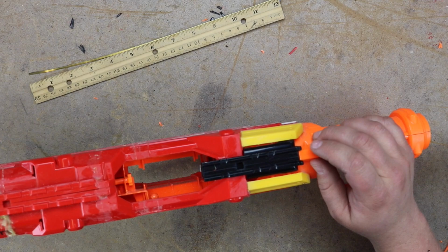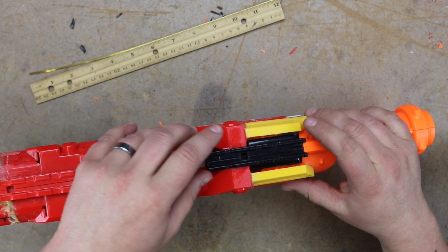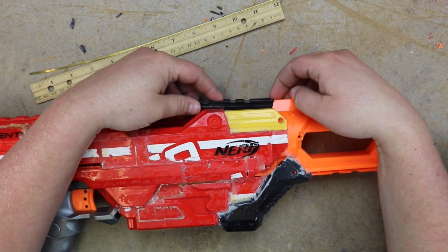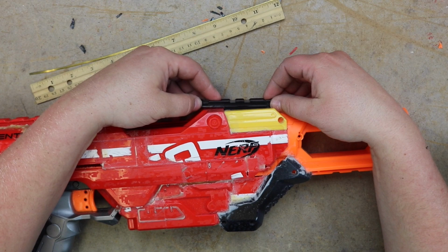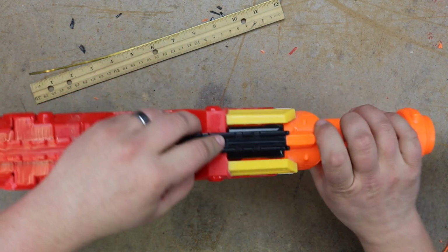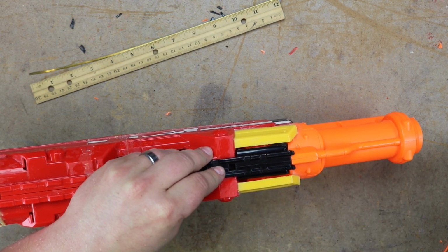And kind of like we did a while back. What the heck were we doing? Trying to fit the angle on stuff. I think I'm going to tack the front, since it's easy to find the level, or make sure that these surfaces are level. We'll tack the front, then we can fine tune the back, because it's going to be a little trickier to line up both sides of the shell where we need it. So let's get this guy where he needs to be. That's pretty good.